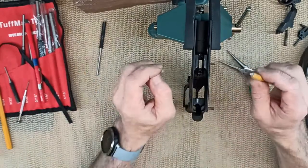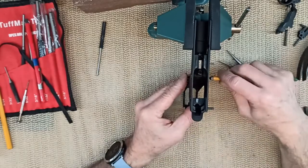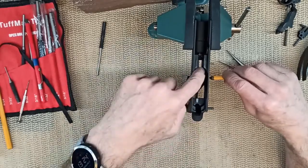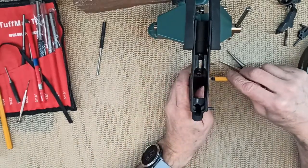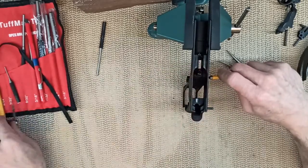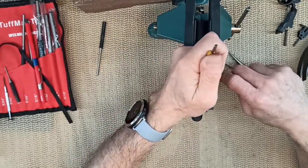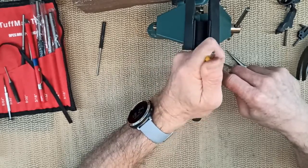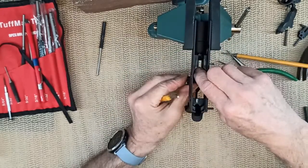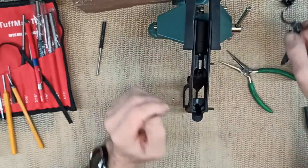And then you need a pretty small punch to place inside the magazine eject. You can push it, the magazine eject is not going to go anywhere because it's retained by that pin. So you're going to push it hard to push that detent. Now you push on that pin down. I like to use another tool because it's pretty hard on the finger. So push this one, then the one down, then release that punch there, and everything is in. All right, next, the trigger assembly.